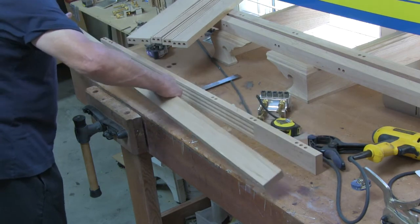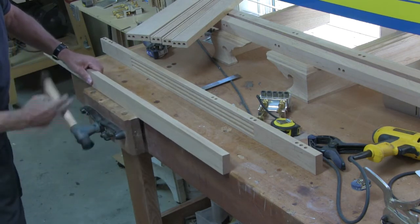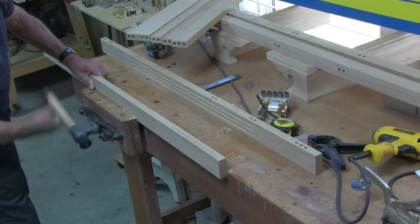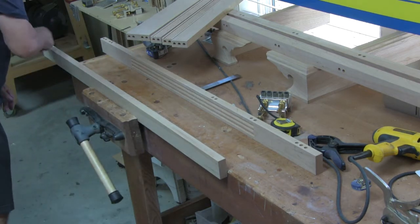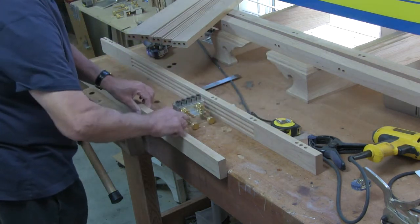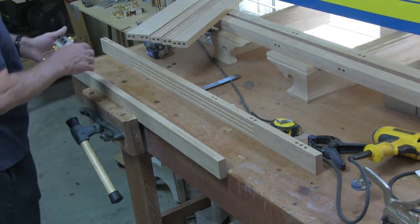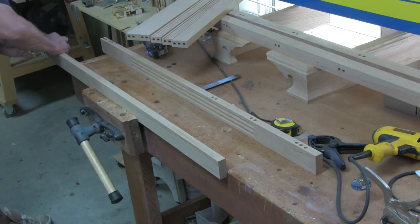So, this one's already done — there's a check mark. The check mark is here, the X is here, and the top edge is here. Now, it's 7/8th thick, so 7/8th half to 7/16, less 3/8th is a 16th, and we've got a 16th spacer in here. The check mark goes to the check mark here, and we bring this up to the end.